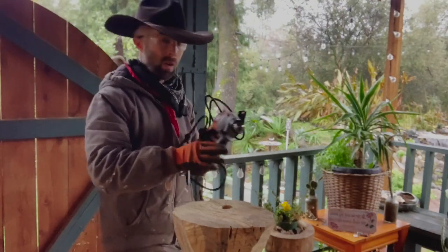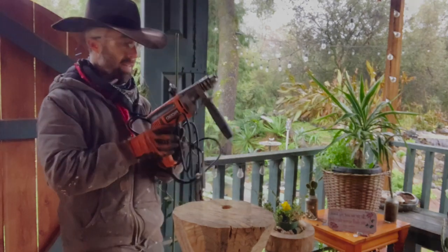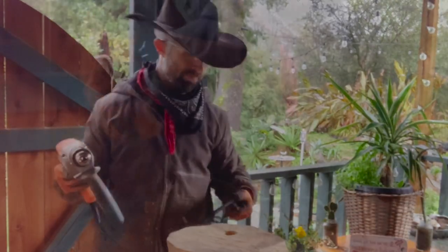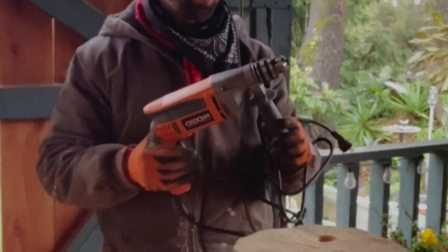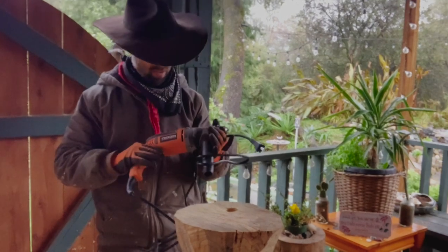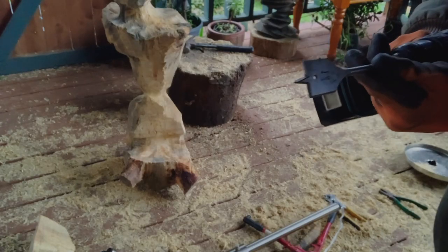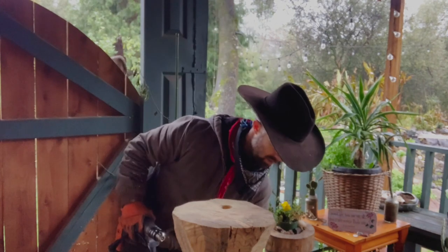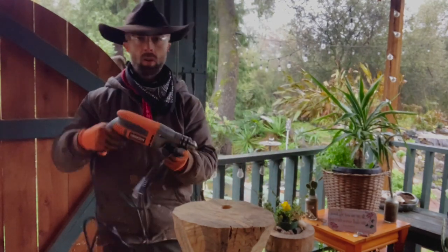What I've learned from drilling in railroad ties, for some really heavy duty stuff and some long cutting, for my preference, you're going to want an electric hammer drill. This is the half inch hammer drill from RIDGID, and I'm just going to put this 1 3/8 bit in here, plug this in, and then work this.